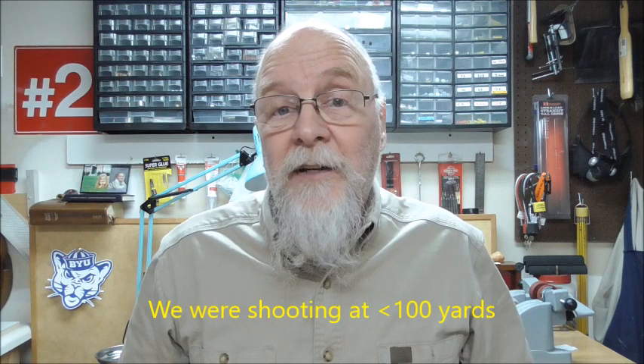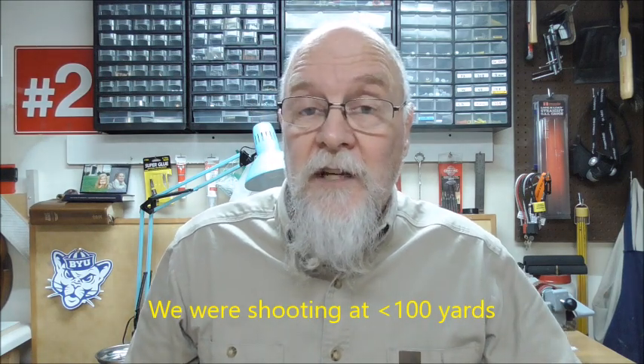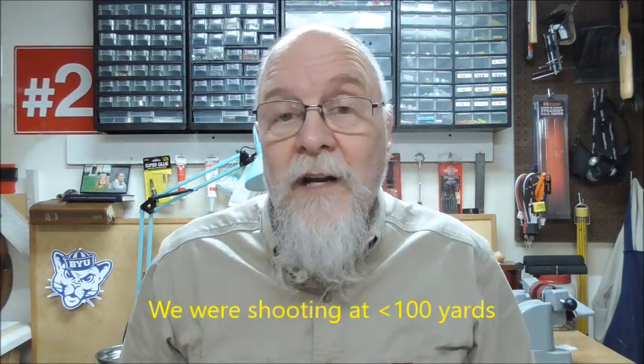So what caused that? I was out shooting with some neighbors and I didn't realize that my neighbor had brought his 7mm mag. As you'll see in just a minute when I put up some data on the screen, with a 7mm mag you don't use three-eighths steel. You need to use half-inch steel if you're at 100 yards or less, maybe even out to 200 yards. We'll have to look at the data.